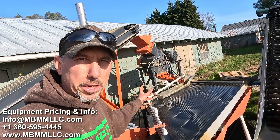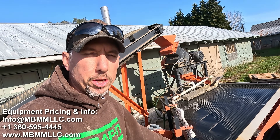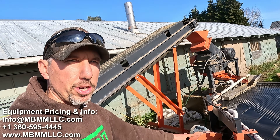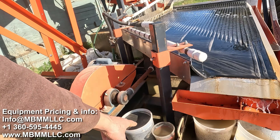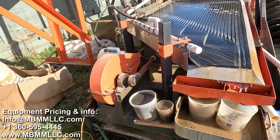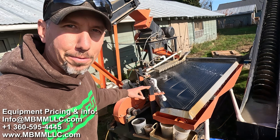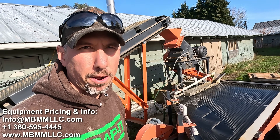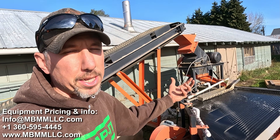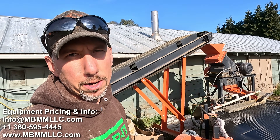We're all done with our run. I got the shaker table brushed down and all concentrates are off into number one or number two, but I'm going to take the number twos and rerun them back on the table — about a quart or half a gallon, two liters for everyone else. I want to pull any tellurium, tellurides, or a little bit of free gold out and move it into the number ones. I can do that just by rerunning it on the shaker table.